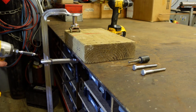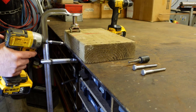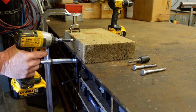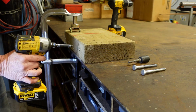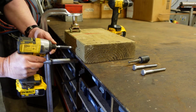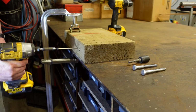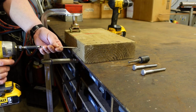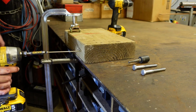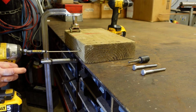Okay, we've established there the drill driver does drive it in, no problem, but there's significant reactive force being exerted on my wrist, whereas the impact driver, you can just hold on to it lightly and it goes in. I'll just demonstrate that again now. Ooh, hot. Right, we'll start. Okay, and I'll just do this with one finger if I can at all.